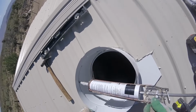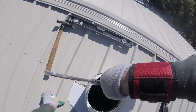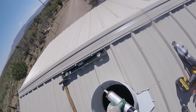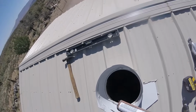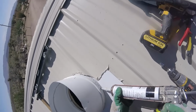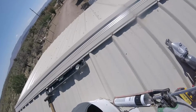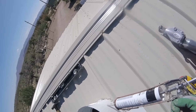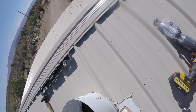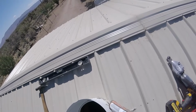In hindsight, I probably should have waited on this part of the caulking on the inside, because there is a little metal hold down piece that you attach, which keeps this elbow from rotating around. I will put that on in a minute and get caulking all over my fingers. I'm sealing all the small little holes there that were there for the pitch alignment, and any other holes. The last ones there I shouldn't have sealed right away, because that's where I believe I attached the metal piece that holds the elbow from turning.